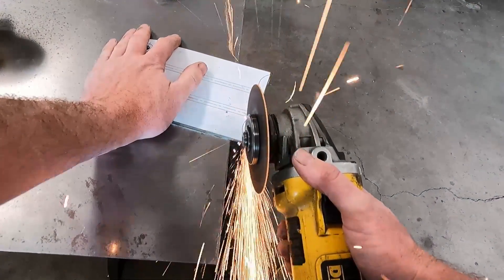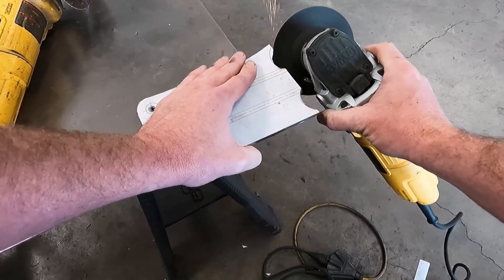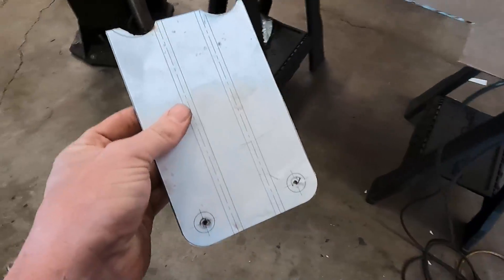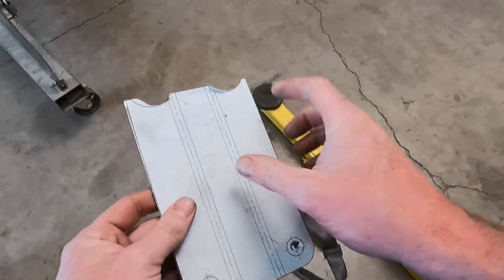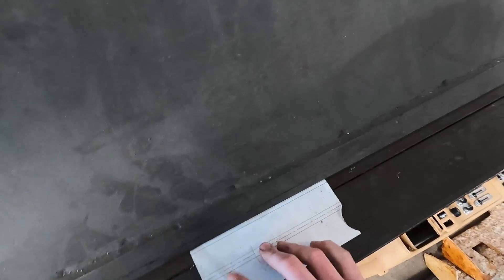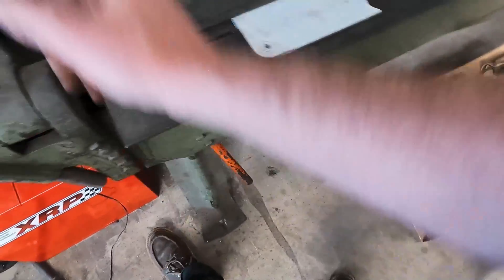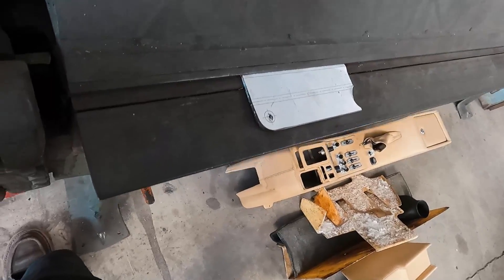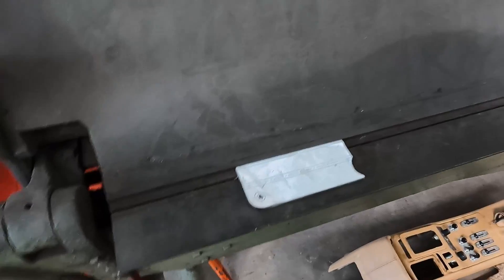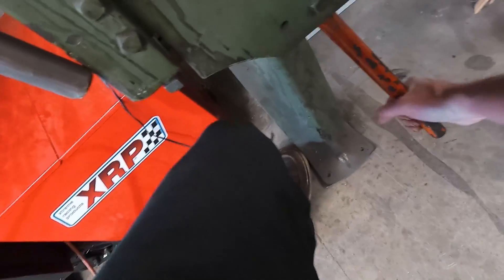I decided to go ahead and cut out the lower copes that will connect to the bushing housing. I didn't completely finish the job — the paper started lifting on the corner — so I figured it would be smart to go ahead and bend this up now instead of risking having my paper lift. Now I know not everybody has a giant sheet metal brake, but there are other ways to bend sheet metal. You can use a vise and a hammer or make a makeshift one on the edge of a workbench. Or you can draw the part in three pieces and weld it together — I thought about doing it that way if this wasn't going to fit in my brake, but thankfully it does.